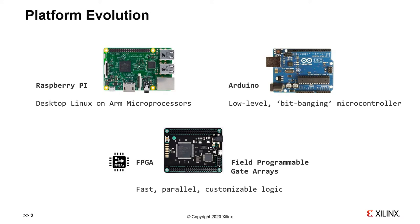The third category we want to consider is the FPGA, which adds a new dimension. FPGAs are not a type of microcontroller or microprocessor. FPGA stands for Field Programmable Gate Array — Field Programmable meaning user-programmable, and Gate Array meaning an array of logic gates. What differentiates FPGAs is that the user gets to define the hardware architecture or the circuit they want to build for their application.